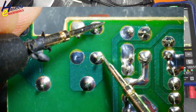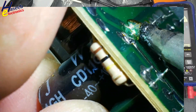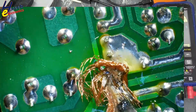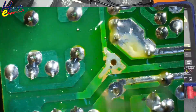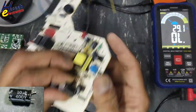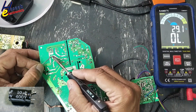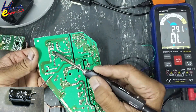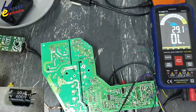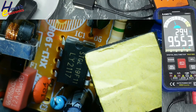We will verify the fuse — the fuse is good. Check capacitor polarity: negative polarity here. The rating is 10 microfarad, 400 volts. I have a 10 microfarad 450-volt replacement instead, measuring 9.6 microfarad — good, I will use it.